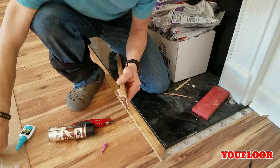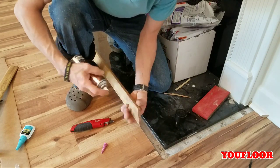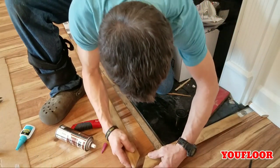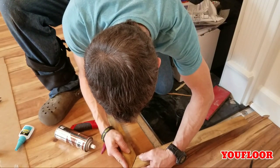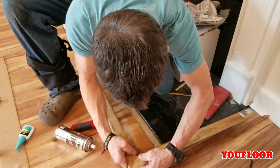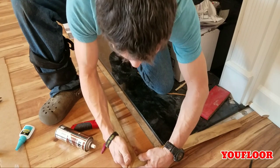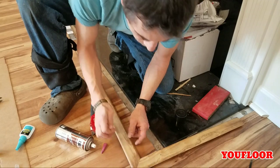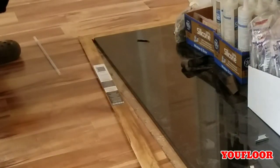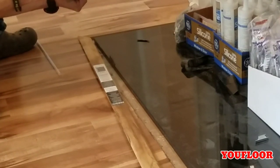One is a cyanoacrylate glue, which is basically super glue, but I love this kind because it's really thick. The other stuff is the accelerator, which makes the super glue cure almost instantly. You just put the CA glue on one piece, then spray the accelerator on the other piece, and when you touch them together you literally have about four seconds and the two pieces are stuck like chuck.